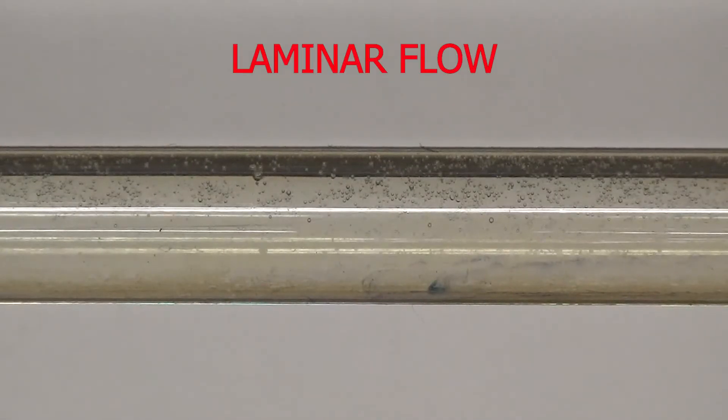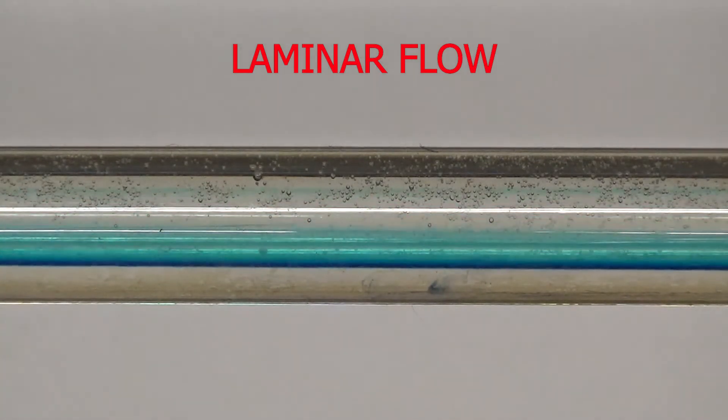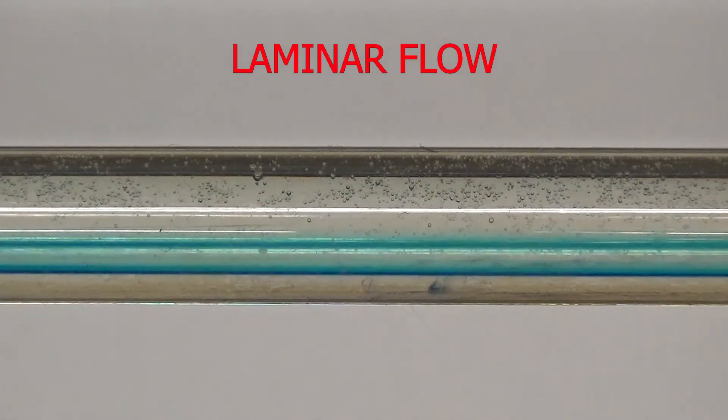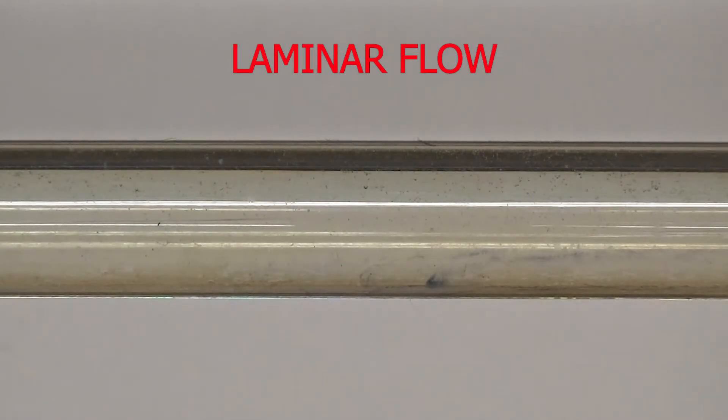Let's take a look at all of this downstream. Under laminar flow conditions, looking at the end of the tube, I'll send a few short pulses of dye through the water and hopefully we'll see a velocity profile. Oh, that's actually beautiful — that was really good. Now I'm going to see if we can have a continuous streak of the dye.